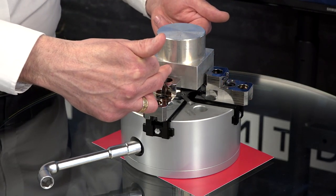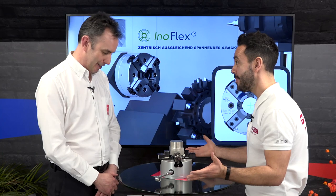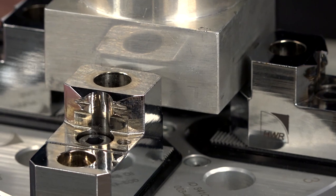That's fantastic — so effectively you've got like two centric grippers, two centralising vices in one. That's exactly right. Now this is a manual product but you've also got power versions? Yes, we have a standard manual chuck which is key operated as you can see. We also do a power chuck with a through hole, a power chuck with a closed centre, and then there's also a much bigger lightweight version in the form of a crucifix for big vertical boring machines — that's to take the weight out, and it can go up to 1.2 meters and beyond.